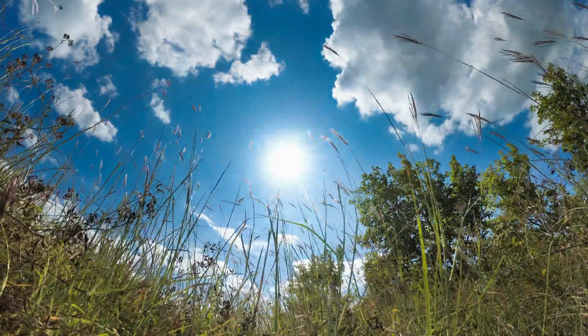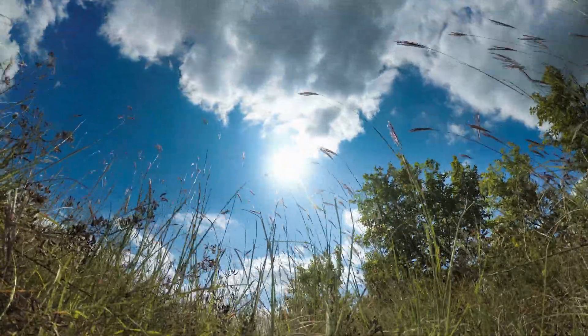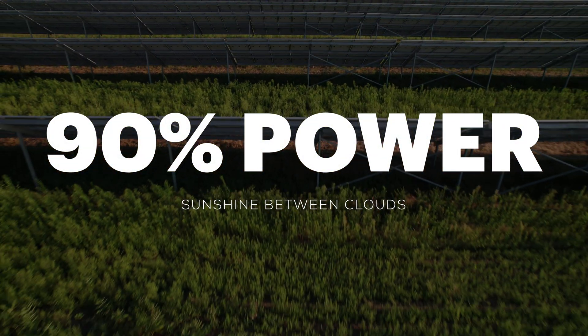The best situation I find with solar is when you've got a cloudy day with fair-weather cloud — very white, fluffy clouds — and the sun's behind one of those clouds so the panel is cooling down. You've got good conditions as far as the panel temperature goes, and the air between the clouds is also incredibly clear, the sky is crisp and blue. When the sun comes out from behind one of those clouds and is just in that in-between point before the next cloud arrives, that is when you get your absolute peak production. It will shoot up and you will see the best output from your system — sometimes almost factory spec. They don't usually stay like that for long, probably because of the heating of the panels, but during those times in the clear air between the clouds, that's when you're going to get the most.